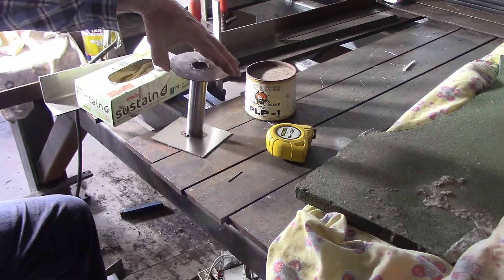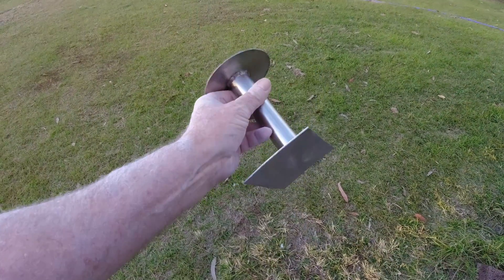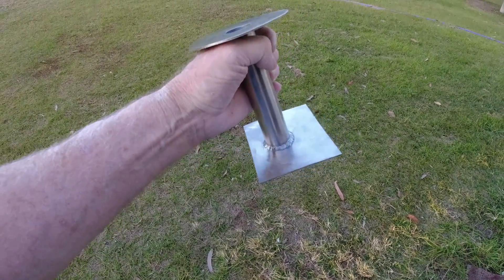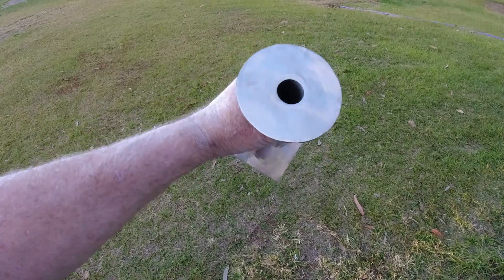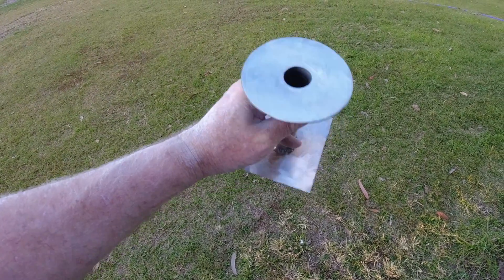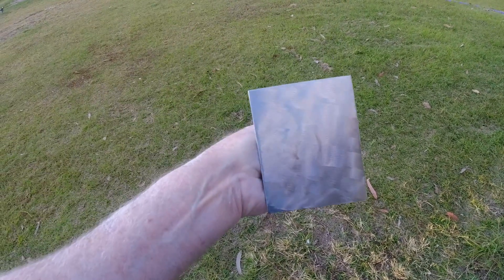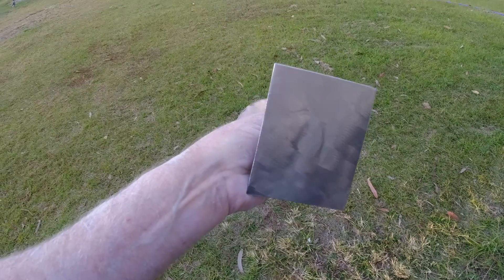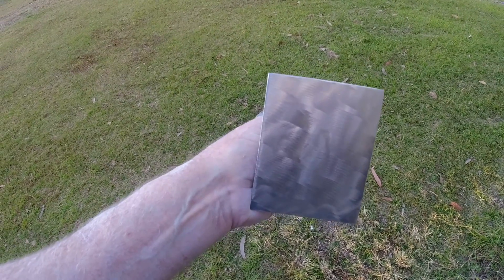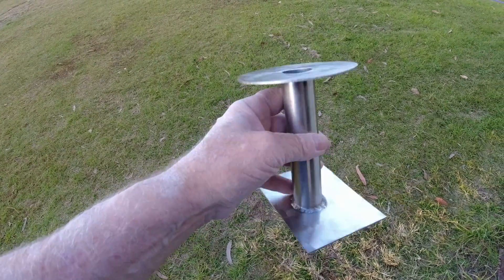Right, I'll take it down and have a test fit. That's the mast to mount the SCX-20 satellite compass on. Now I've just got to drill it — three holes in the top to mount the compass itself, four holes in the bottom to mount it onto the boat, and one hole through the centre for the NMEA cable. I ruined my brace on the top one, so I'm going to have to try the bottom one with a step drill.